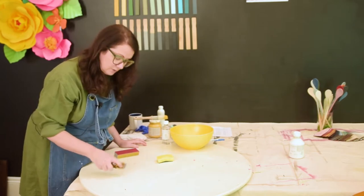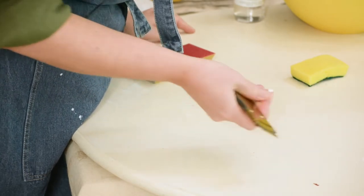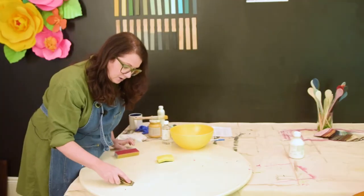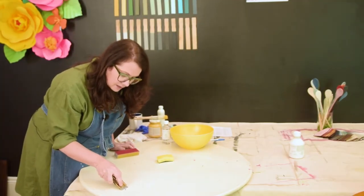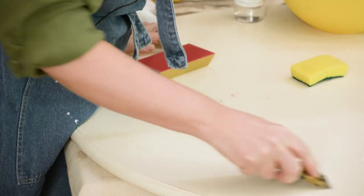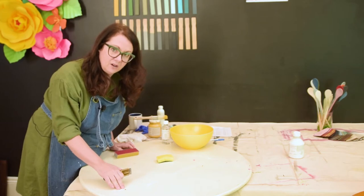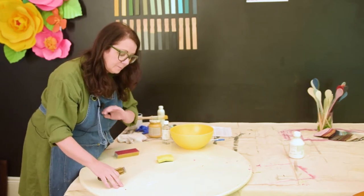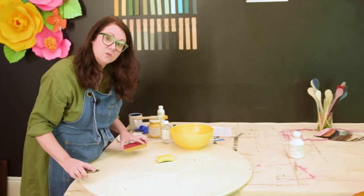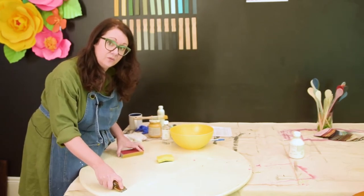This piece has had paint dripped on it — it's been used as a work table — so I'm going in with a scraper to remove that. That drip would have presented as a ridge that eventually comes off. I can also see that the previous paint didn't bond very well, so I'm getting some loose paint. If you ever have loose or chipping paint, you want to instigate it to come off. Scrape it, sand it with a palm sander or by hand to smooth out the ridges — because if that existing paint isn't stable, neither is your new coat.